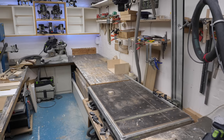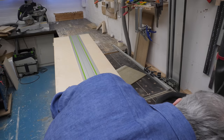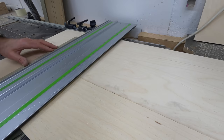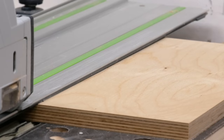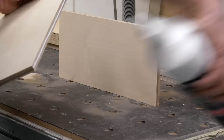I'm going to be using 12mm birch ply for the box sides and base - I'd like to use something cheaper but it's all I've got right now. I'll start by ripping it into strips, then crosscutting it to length, and then make a start cutting the drawer fronts from 18mm birch ply. With all the parts cut I can start putting the boxes together, keeping the construction super simple with glue and nails.